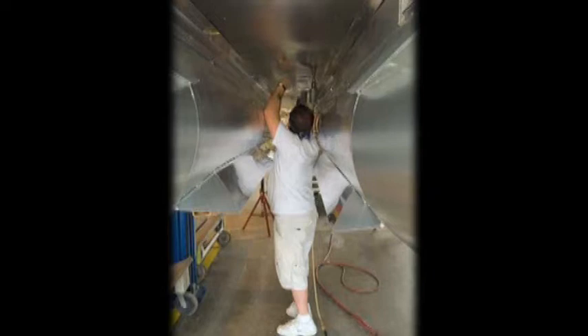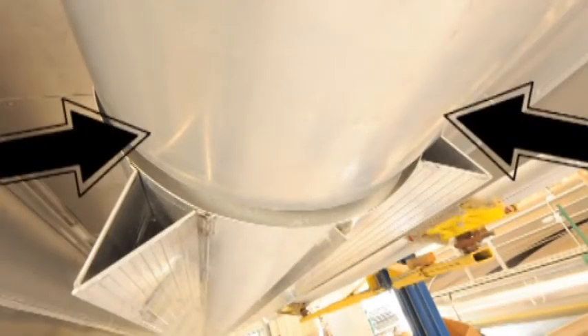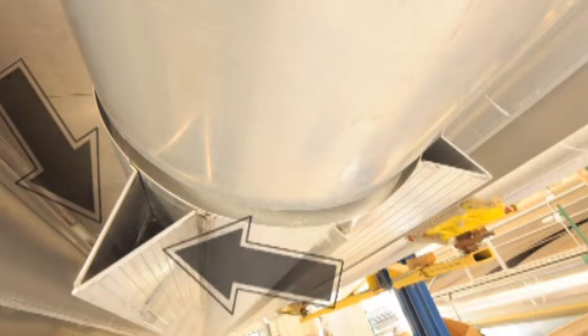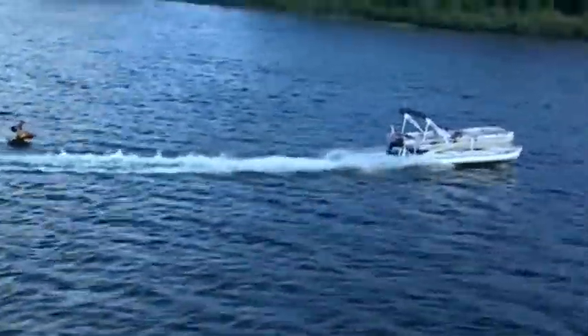And combined with the flat under-deck aluminum skin, drag is reduced and performance is greatly increased. This design mounts the fuel tank below deck in the rear center, and it becomes part of the running surface as opposed to hanging over the end of the tube. Due to the innovative design and placement angle of our interior lifting strakes, outer strakes are not needed, which results in a smoother, more controlled ride without sacrificing hole shot. Your first voyage on a Performance 3 will convince you that the balance of performance and pleasure has been achieved.